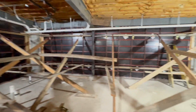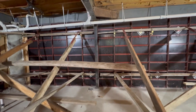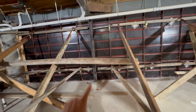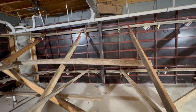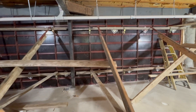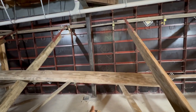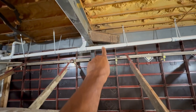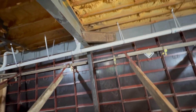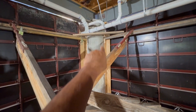You can see our piers in the corners. The pier in the center wasn't supported properly, so we removed it and put in a steel support — we do whatever it is that needs to get done. This happened to have been done on the fly. Engineers couldn't make up their mind exactly what and how, so we came up with bracing it at the top, putting our 4x4 heavy gauge steel and tied it in, welded it at the top, and everybody seemed to be extremely happy with it. So we're continuing, but I would have loved to have that general support in.